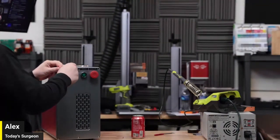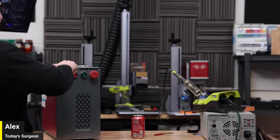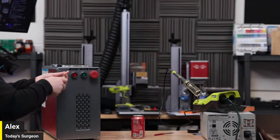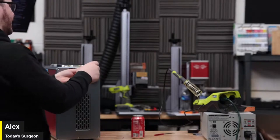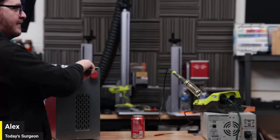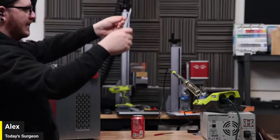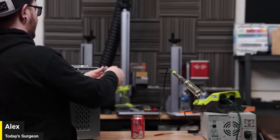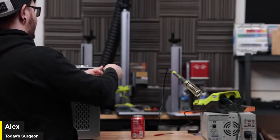Go to Coherent's website and look up their excimer systems. They're like the size of a room. CO2 galvos do pretty big stuff. Like they do the jeans, they project those across half a room. You'll get a 500 or 600 millimeter lens. That's how Levi's distresses jeans. They hang them and blast them from across a room essentially with a CO2 laser. So it exists, but that's super specialized and it's got to be crazy expensive.